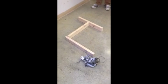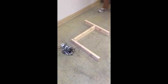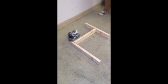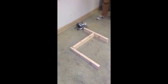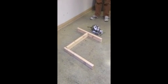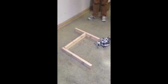And do you feel like the D is contributing? It's definitely minimizing the oscillations. Without the D gain, we're definitely having oscillations. Oh, that is great. That is absolutely the evidence that we didn't see with the line follower. Even if this is all that happens, I feel like it's good. You can definitely tell after we put the D in, there was no oscillation.